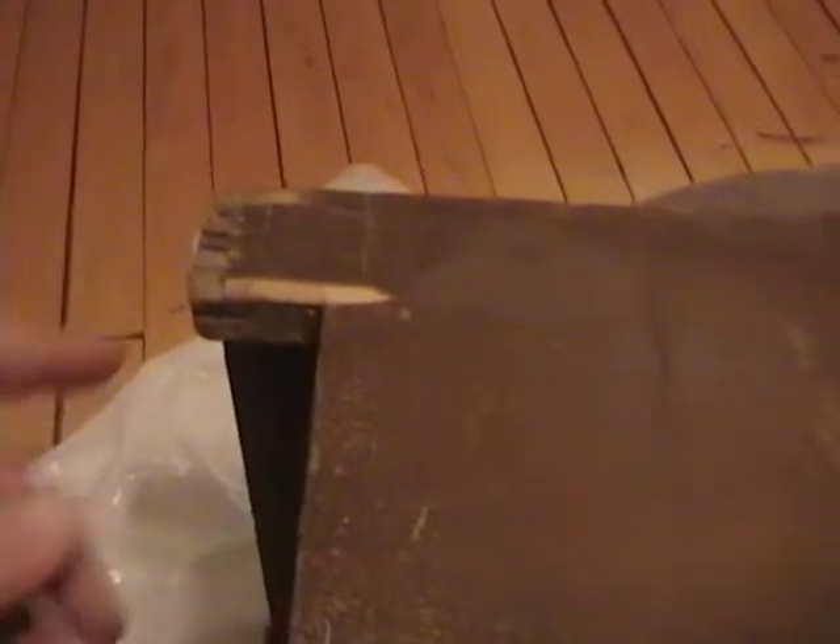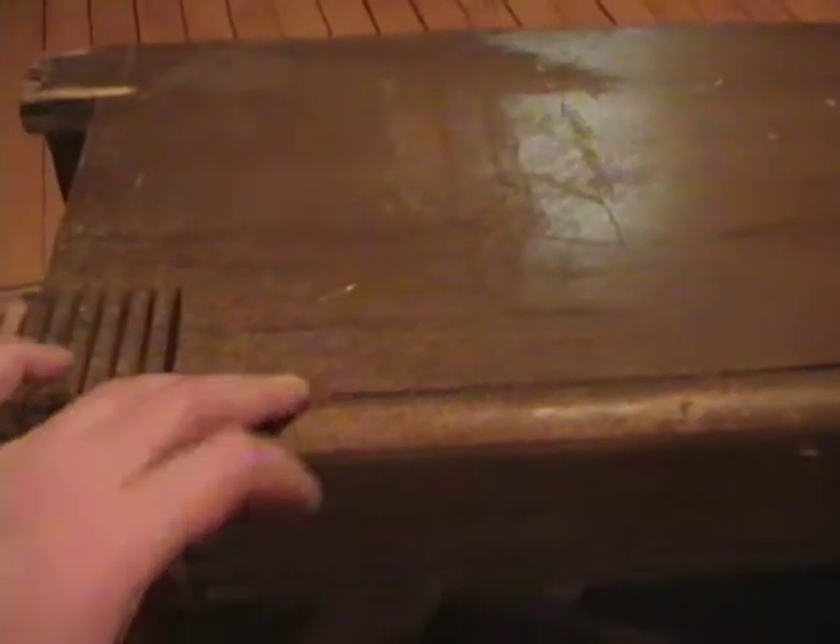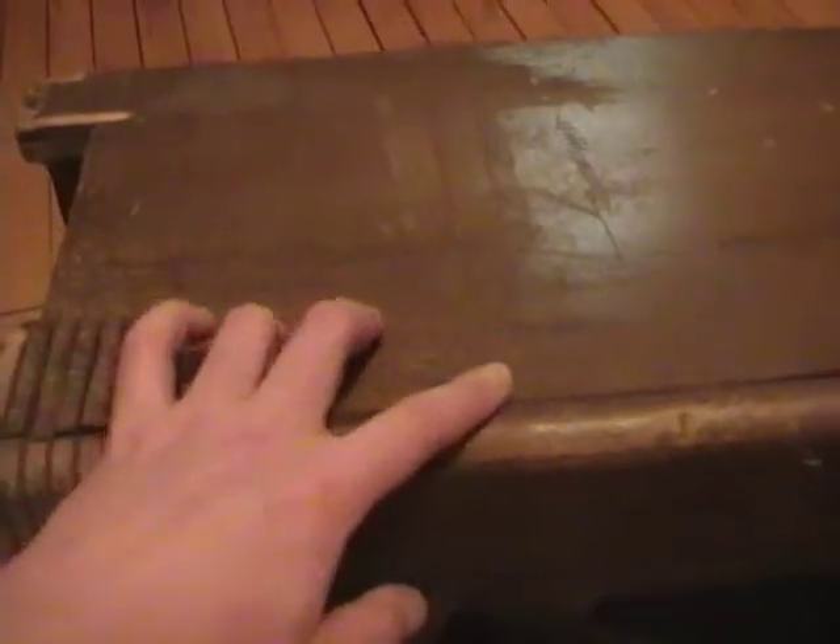And likewise over here I'll patch in veneer as best I can. I could use wood putty, fill it in, level it out, and try to make grain marks in the putty — but I've got the veneer, I've got the time and patience, so I'll try to redo it properly, even though it's a pretty intensive project. Once all that's done, I'll strip it down. It's best to do all the veneer repair gluing before you strip it — that way you get the protection of the old finish from the clamps. Also, when you strip it you can take away any excess glue that oozed out onto the surface, and it'll come down to a nice bare wood.